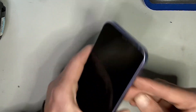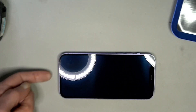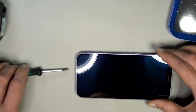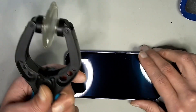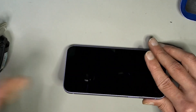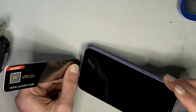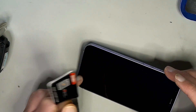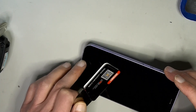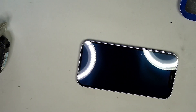We have no audio on the top speaker. I already heated it up. The two bottom screws are already out. I'd highly suggest using a spudger like this — don't put any thin metal tools in here like on the old iPhone 11 or 10. That works, but it's very dangerous because all the flexes run through there and it's easy to cause damage.